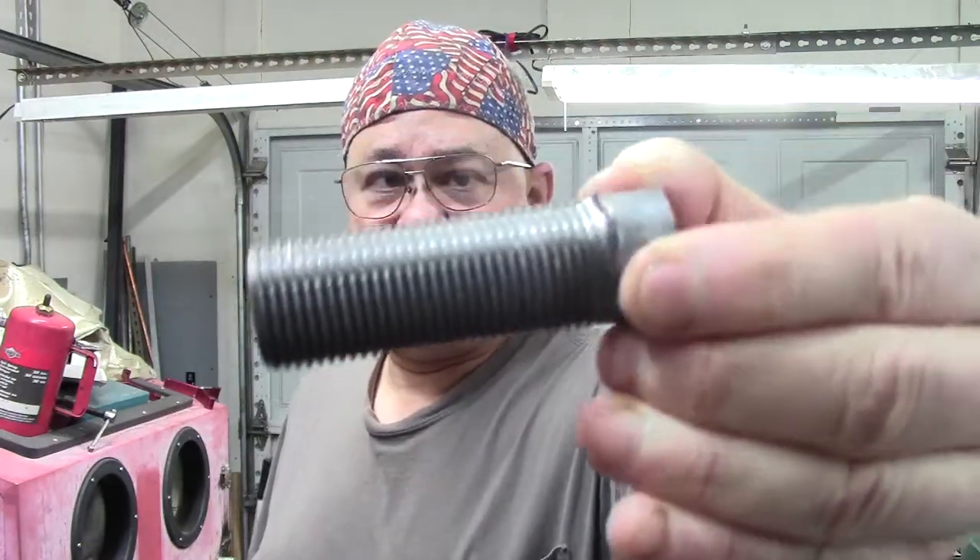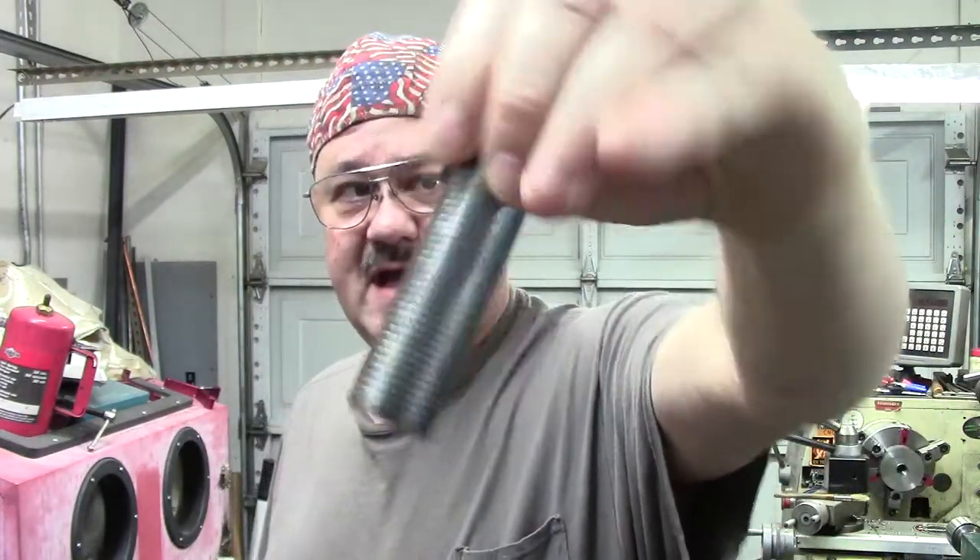Just recently had a customer wanting to make some parts. He gave me the die, I glanced at it, and I knew it was a re-threading die. Now, in oddball instances on certain material it will cut. But in this case, it was started straight and everything was aligned, and you can see it just dove in and then it didn't cut on the back. I wanted to save that to show people, and also let the customer watch the video and see.